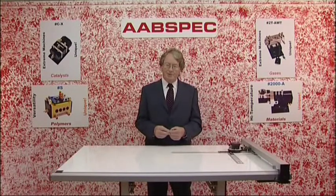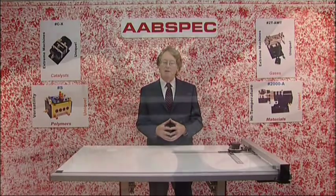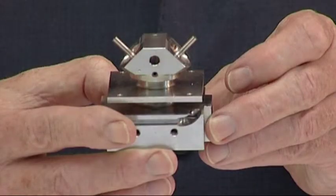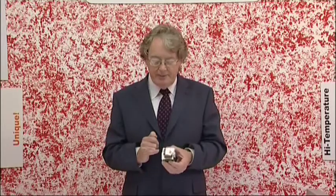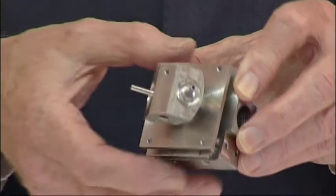All of our products have something special about them and I'd like to start off by trying to illustrate this for you by showing you the heart of one of our liquid cells for spectroscopy. It started life as a single piece of 316 stainless steel and all of the details were machined into the solid block — that includes the inlet pipe and the outlet pipe. All the material has been cut away to leave the pipes freestanding. The reason we do this is to avoid welding or brazing, and this in turn means that the product has less chance of localized corrosion because we have no welds and no weld joins.